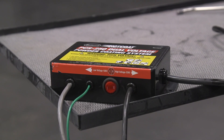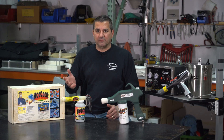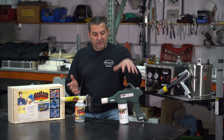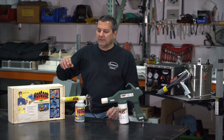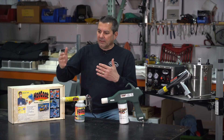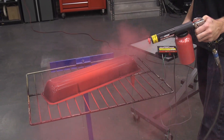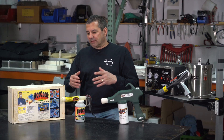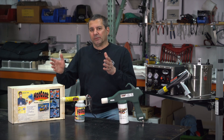The PCS 250 is a nice one because it's our dual-volt gun. You have a switch in there — you can have 15,000 volts or 25,000 volts. Why do you need that? The 25,000 volt setting lets you do those larger parts: a big wheel, intake manifolds, mower decks, whatever you want. Then if you want to come back and do some detail work, second coats and stuff like that, you dial it down and hit those areas. It's a real nice evolution from where we started and what we learned to where we are right now.